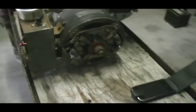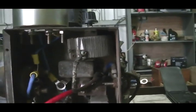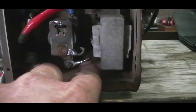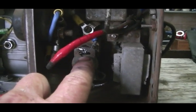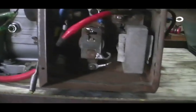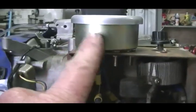SD wanted to have a look in the little magic box — you must have missed the first video. So here we just have a 5 ohm wire wound pot, which is to increase and decrease the amperage coming from the generator. We have a big heavy wound inductor, just a single wire. It goes through to a second inductor, which also acts as a magnetic switch. Once the generator fires up it pulls in and connects the circuit to the charge. This stops any power going back the wrong way when you push the button to start it. And of course, just our amp meter on top.